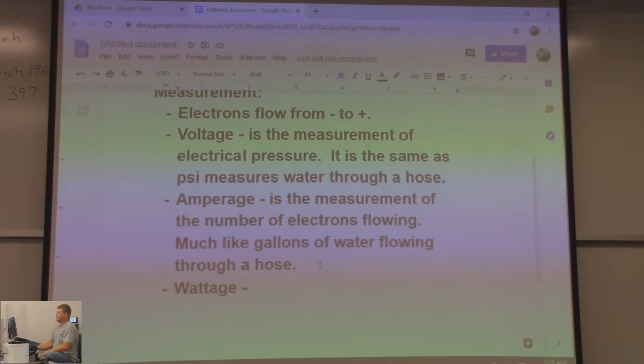So we have voltage and amperage. On a stick or TIG machine, the main adjustment is amperage. On a MIG machine, it's going to be wire feed speed and voltage. We'll go over the types of power sources in a minute as far as how their power works.